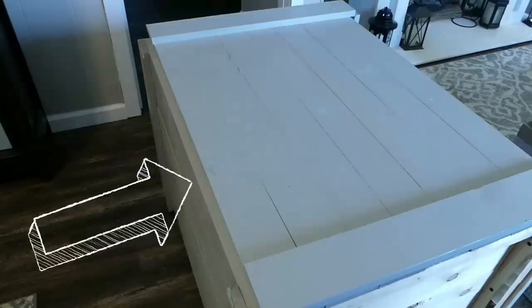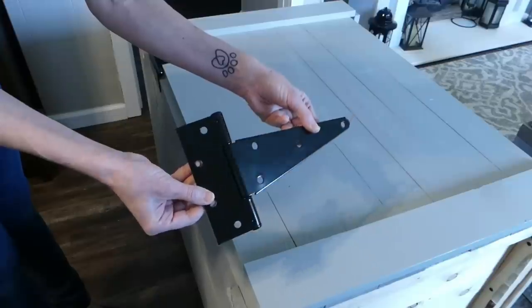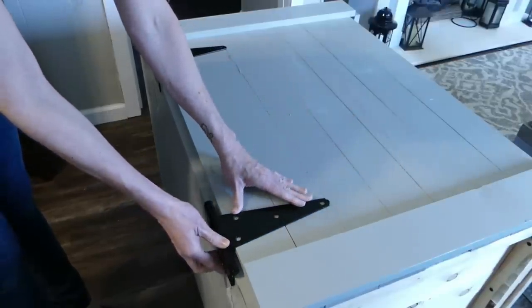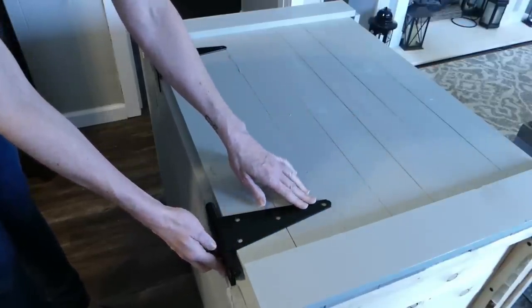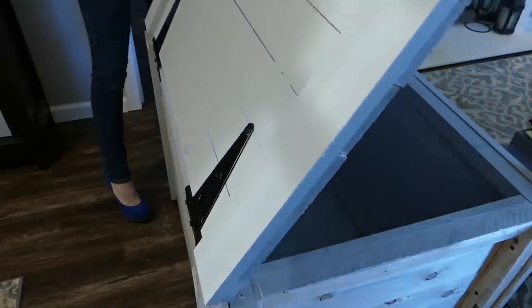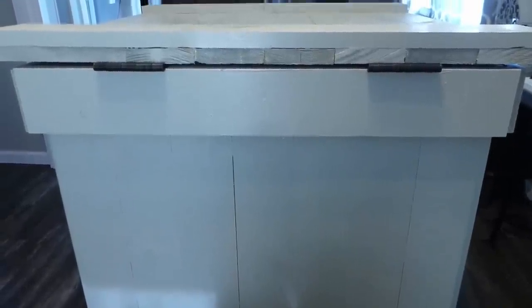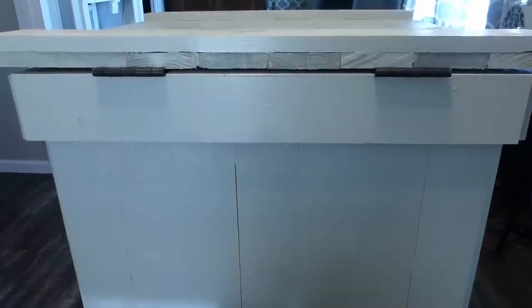Place the mailbox on its back and the door on top so the edge with no extra is lined up with a 2x2. Place the hinge so the knuckle is on the inside and use the accompanying screws to secure the hinge to the side of the mailbox. Use the shorter 0.75-inch screws and washers to secure the hinge to the door. Stand the mailbox up and place the top so there is no overhang on the back — there should be equal overhang on the sides. Drill pilot holes and screw in the hinges.